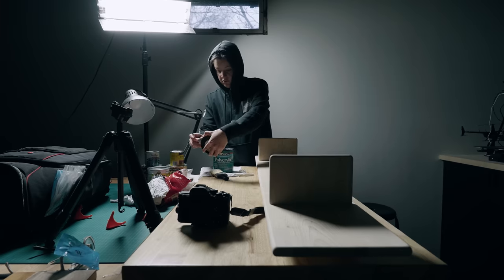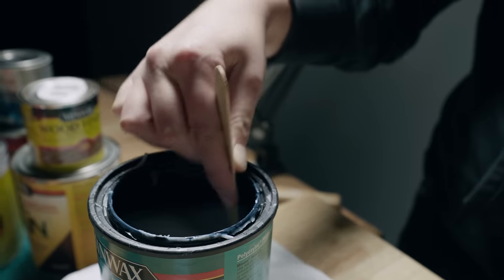We were not happy with the stain at all, but once the desk shelf was assembled I actually really liked the way it looked natural. There's a quote from NS Builders — a YouTube channel, highly recommended — that kept playing in my head: don't try to fake a wood color with stain, just get the real wood. So if you're trying to stain something walnut, just get walnut. It'll be more expensive, but factor in all the time we wasted trying to get the stain to look right — should've just gotten the walnut. We didn't want to buy new wood since we were using scrap, so we just clear-coated the entire thing with three coats of water-based matte polyurethane. The finish is very natural and flat.